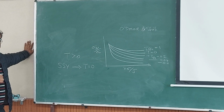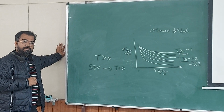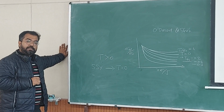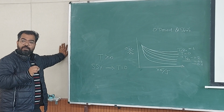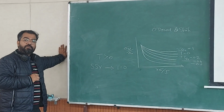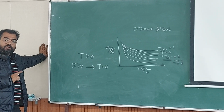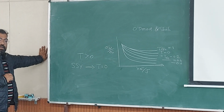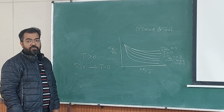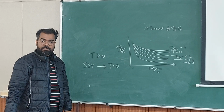And the other benefit of T stress is that T stress can be calculated from K values. Or you can also calculate T stress by theoretical means, by putting the equations. And you can also find out T stress by doing line integration. That we will not discuss. Okay, that's a numerical integration scheme from which T stress can be calculated. But remember one thing, if you want to calculate T stress by using a finite element model, then you cannot use plasticity because it's not a plastic thing.